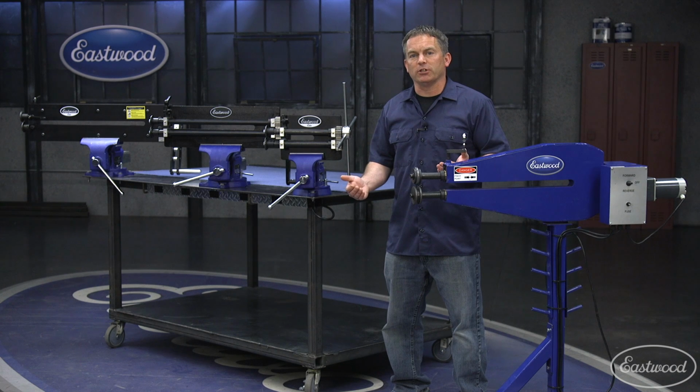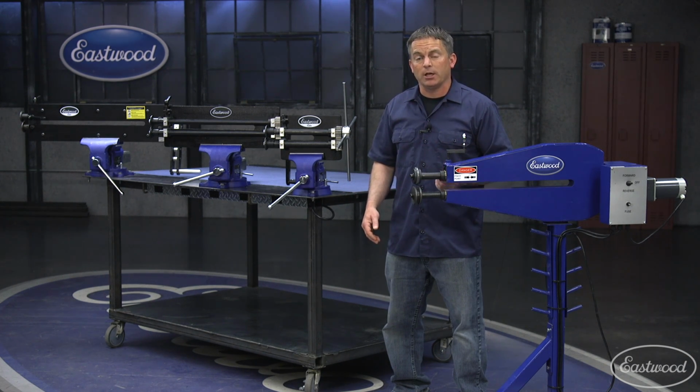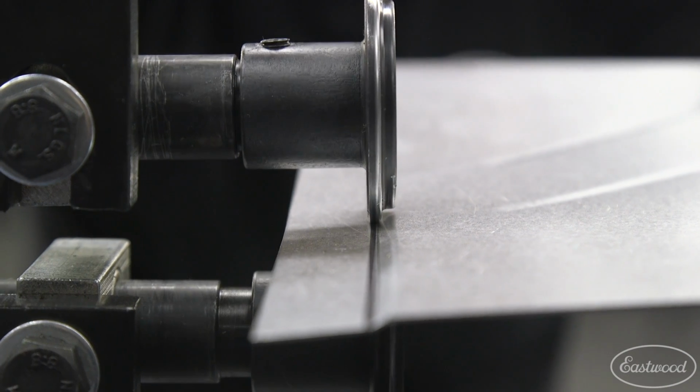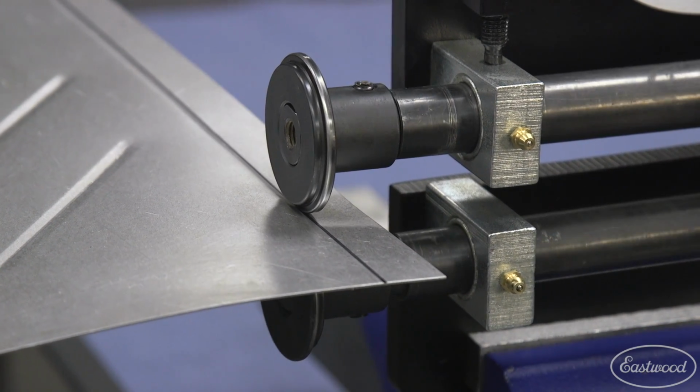If you've done some research, you may have seen that many bead roller kits come with a few sets of flanging dies. But a single set of offset dies, like you get with these 3 units, basically replaces an entire multi-piece set of flanging mandrels. This is because they're so versatile.